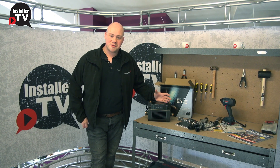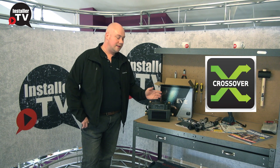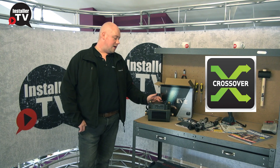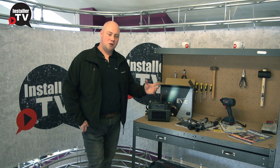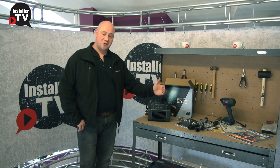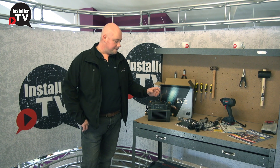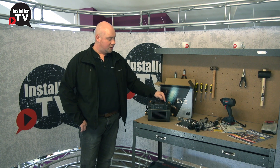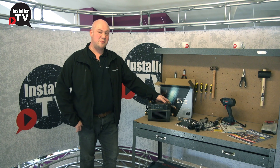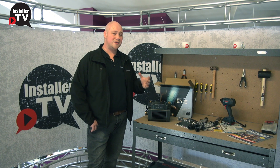EVE is a whole house pump. We've built in what we call crossover technology, which is essentially a bypass link that connects the two sides of the pump together. With a normal shower pump, if you've got a shower set at around 38 degrees and water stored at around 60 degrees, both hot and cold water flow through, so both ends of the pump are working fine. The difficulty comes when you put it on a set of hand basin taps — if you turn one tap on and one off, you get what we call closed head running on one side, which can damage the pump. Because EVE has crossover technology, it relieves the pressure and any temperature build-up on that closed end, relieving it on the open head side. This allows EVE to be used on individual outlets as well as standard mixer showers.